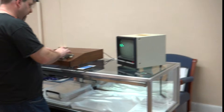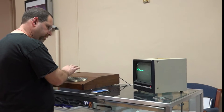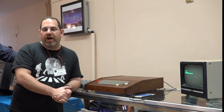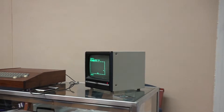So we're going to put in the address and hopefully get a nice load on this. We have to get BASIC into the variable state. In about a minute it should load. Now this cassette adapter runs at 1200 baud, which was an incredible speed at the time considering it had very few chips. Most cassette adapters were gigantic with lots of analog electronics. This was completely done digitally and in software, where tricks were used to create analog signals using digital chips. There's only one analog component on the entire card - and it was very inexpensively made.